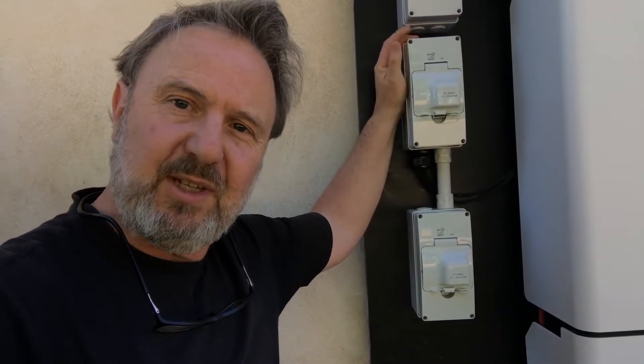What I've done on this particular installation is put a north-south array — two kilowatts north, two kilowatts south. I just love playing with the variation in orientation to show there are many beneficial arrangements and it's not all about facing north. At this time of year, the beginning of spring, we're getting performance on the south face from daybreak right through to sunset. The north-facing array of course provides peak power during the day, but being a split array it moderates that peak, so it's not quite such a peaky output. North and south are equally good for this application for maximising self-consumption.